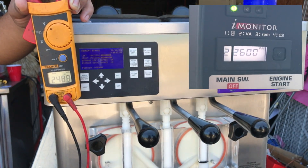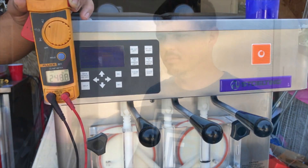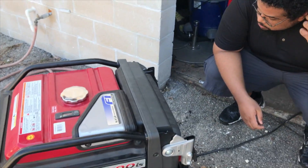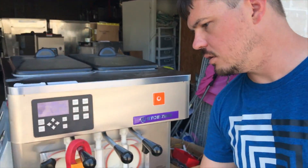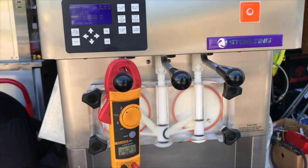We're going to let it continue running and see if it'll bounce back and cause any issues. Now we're going to try this machine with the generator on eco mode. It's going to put a lot more strain on the generator trying to spool up to give it the amount of power required for the machine to kick on. Let's watch this voltage fluctuate and see how the machine reacts.